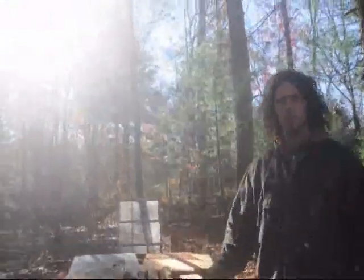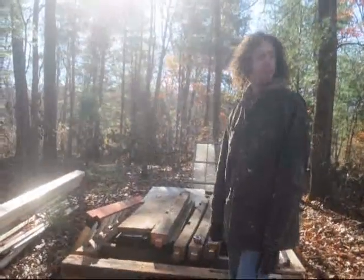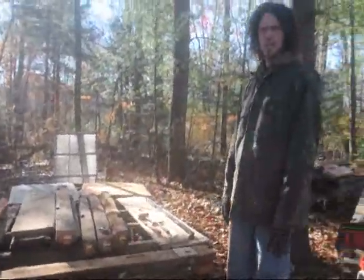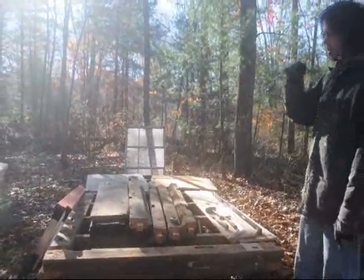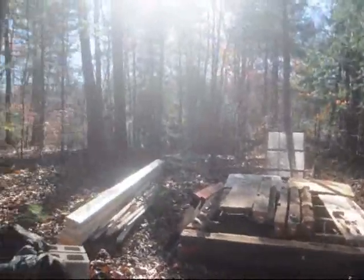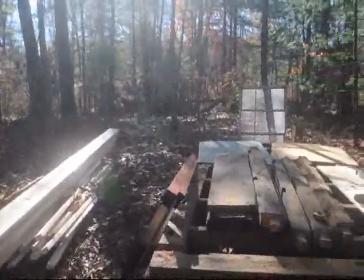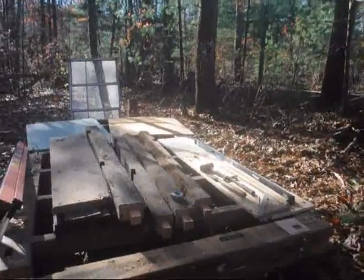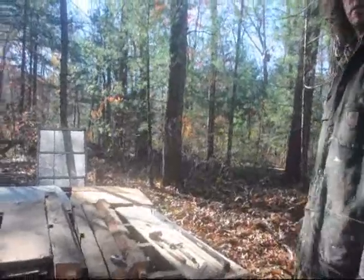This is kind of like my first one. I've never actually done one before, putting together my own timber frame. So it'll be basically a 7-foot by 15-foot long deck that we're putting the posts in, and then just doing regular two 2x8s all the way around the top perimeter. Shed roof, 3/12 pitch, with clear polyvinyl corrugated roofing, just as a shed storage.